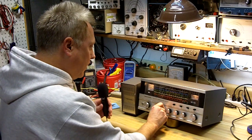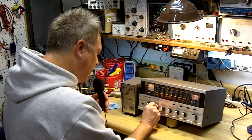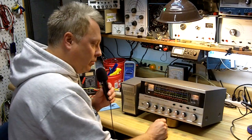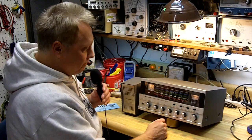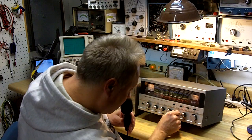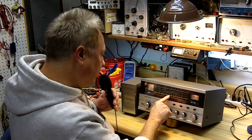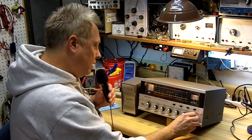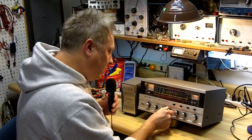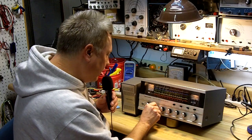Okay, lights up — that's a good sign. Here's some CW, some VFO pitch. I do notice some of the controls are just a little sticky — you can tell it hasn't been used in probably many years. Let's see, here's the main tuning and I'm on band D. Looks like I'm in the 40 meter band right now and hearing some CW, so that's a good sign. Got the antenna trim here, which peaks the antenna, and a little bit of drift there it sounds like.